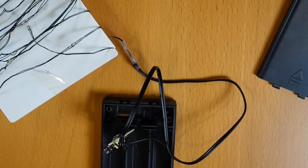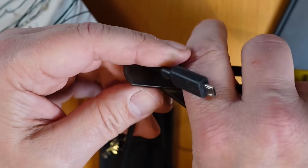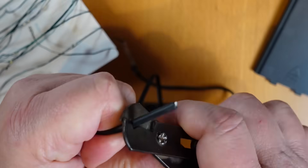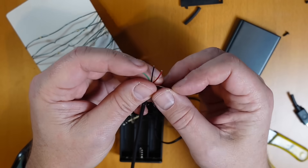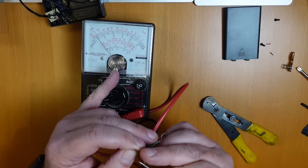Success. Now that I knew the lights worked with five volts, I cut off the end of an old micro USB cable and stripped the wires. I assumed the red and black wires would provide the voltage, but used a multimeter to verify. Yep, I was right.